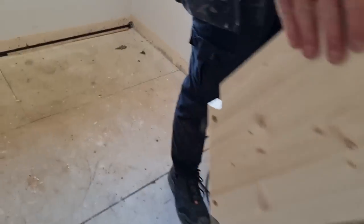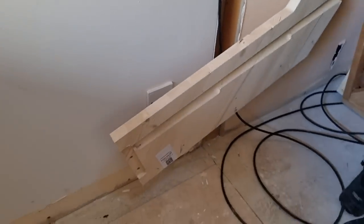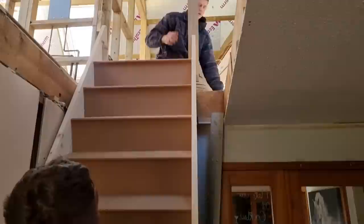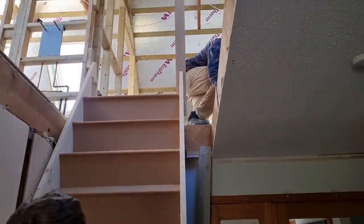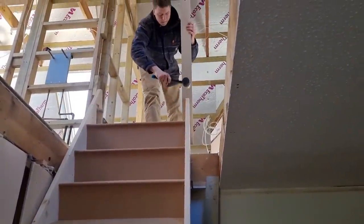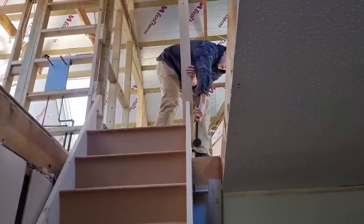So we're not relying on sitting down on this string, because there's a lot of short grain there. We don't want to snap that off. That's very flat, fragile. So what Ed's going to do is he's going to work that newel off. It's really tight. He's going to then ease the side of the tenon and make it a bit looser.